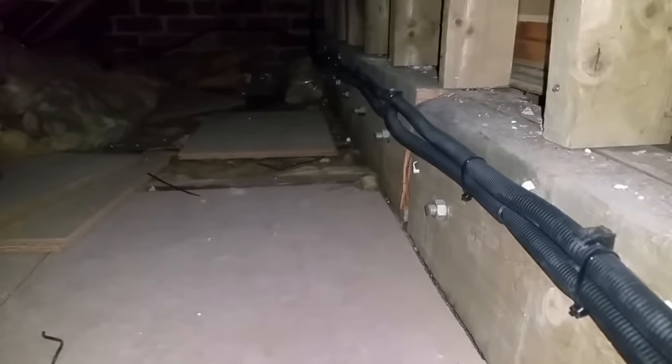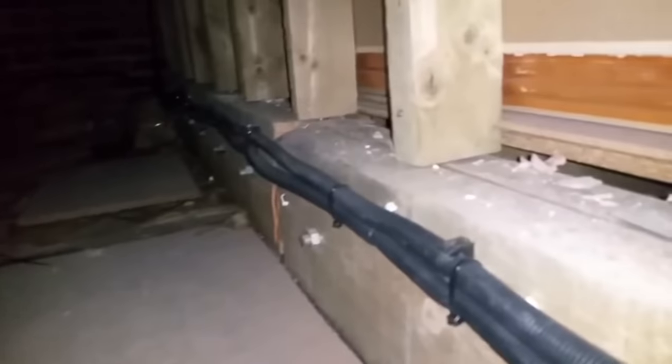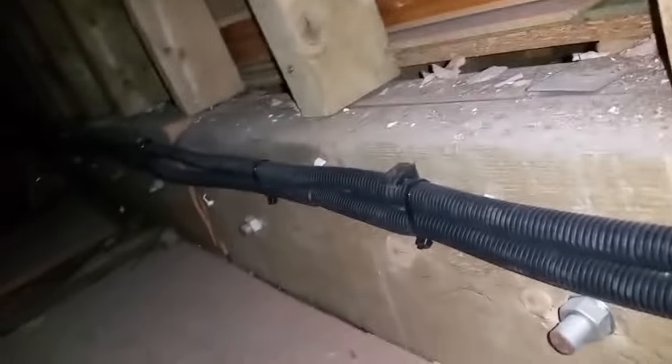As you can see the old clips are there — we've removed all the old wiring. And what we've done is we've actually put some flexi conduit along the length of it. There we go — and that feeds all our old sockets on the other side of these stud walls. We've literally gland-fitted them into the back of our lining boxes. That's not too shabby, is it?